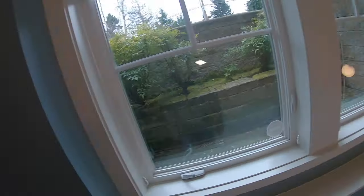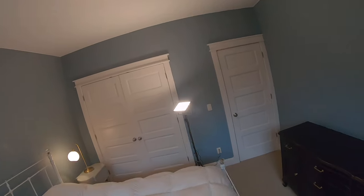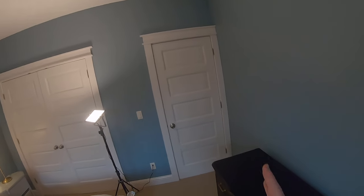Okay, so here you go. This is the end product, as you can see. Nice clean lines around the ceiling. I think the tape provides a better line around all the trim. Baseboard looks good. You notice if you look down on top of the baseboard, you don't see any of the blue. That's why I roll the tape up onto the trim.